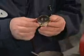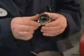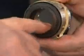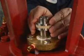Examine the new mechanical seal rotating assembly to ensure it's absolutely clean. It's very important to ensure you don't damage the o-ring of the mechanical seal. Feel for burrs on the shaft which could damage the o-ring before you install the new rotating assembly. Use some silicone lubricant, lightly lubricating the pump shaft, and then put a very tiny amount of lubricant on the rotating assembly o-ring.